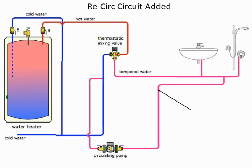When they built their house, I specified for them a thermostatic mixing valve. The plumbing contractor came in and said, you don't need one of these valves, and didn't put it in. So you can see I was going after my children on that one. I happen to be a big fan of these. They are not ever required by the plumbing code. That's the interesting thing. Central thermostatic mixing valves are always a design option by either the engineer or contractor.